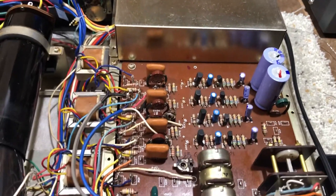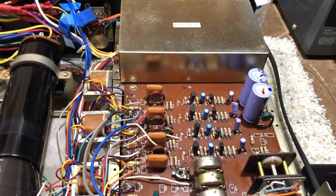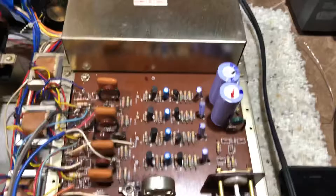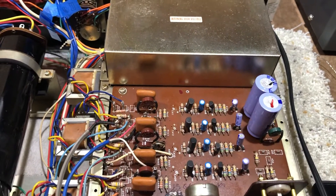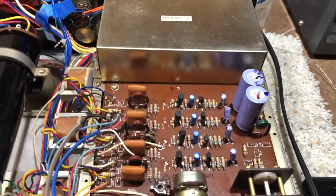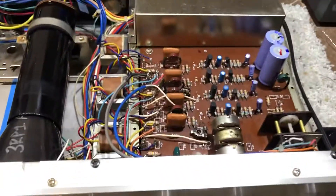I also had to go into the circuitry and do everything I could to increase the amplifier gains driving the deflection plates, because the gains on the 3RP1 are lower than the original scope. I had to do quite a bit of mods to the amplifier circuits — nothing terribly difficult, but just reducing lossy areas and increasing the gain. The front end is all discrete, not op-amps, so there were quite a few headroom problems in the original circuit design where the front stage was clipping before the back stage. I had to do some fiddling to get as much headroom through the system without clipping, because any clipping shows up as oddities in the scope signal.